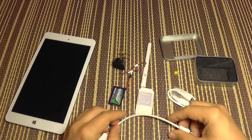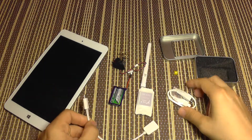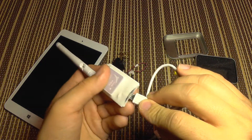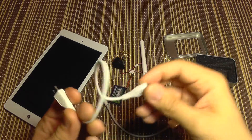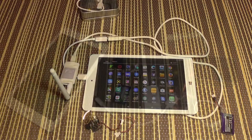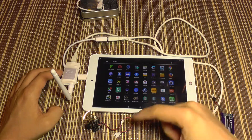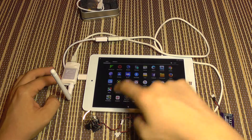Let's install this and connect it to my tablet. Because the tablet has a USB Type-C connector, I'm going to use an OTG cable. If you have a micro USB tablet or phone, the receiver comes with its own OTG cable — micro USB to micro USB — which is very nice as it spares you extra adapters. In my case I need a normal micro USB to USB and then USB to Type-C cable for this tablet. As an application on the smartphone, I'm using the POKEY FPV application. There are a lot of free applications on the market that work with this device, but this one I have tested and it works just fine.